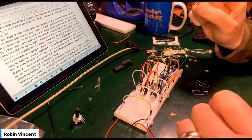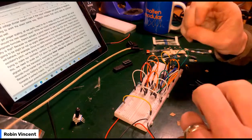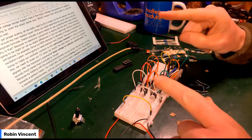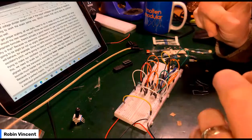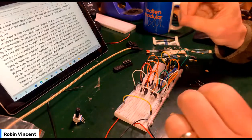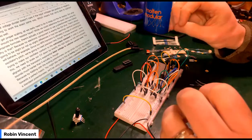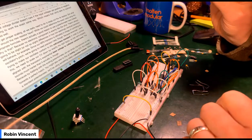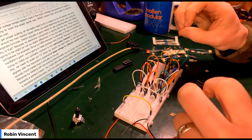So all we really need to do, apparently, is swap out the 4K resistor, which I don't have. I have a 14K resistor. But what value should the new resistor have? While we could determine the exact value using formulas, there's actually a good reason to use a potentiometer here instead. Why is that? Because no electronic component is exactly like another. There's always going to be a slight difference in how two identical transistors behave. All right. So since our NPN transistor is ultimately in charge of controlling the pitch, it needs precision.